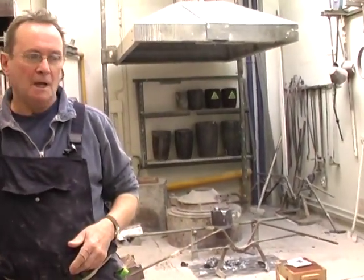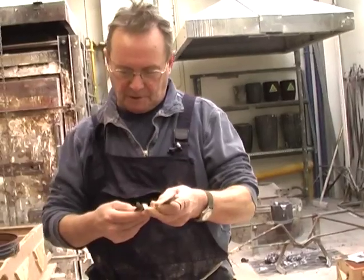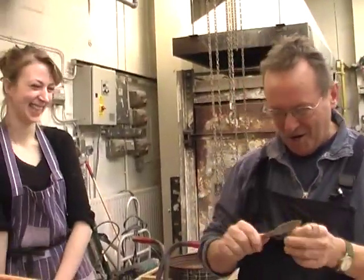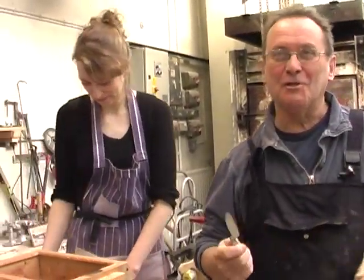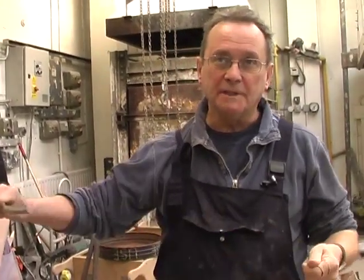So are you still making equipment as you think you need it? Yes, I mean, I know that knives have been disappearing from the university canteens. Oh really? They actually make very good tools. That's cheap. So they're being put to good use and tools like that are invaluable. And this is a bricklayer's tool which is really used for pointing, but in fact it's very good for cutting channels in moulds with a slight adaption — sharpening edges and polishing a little bit to help them run through the sand.